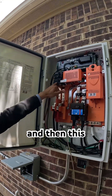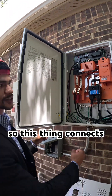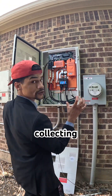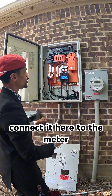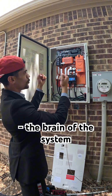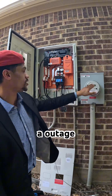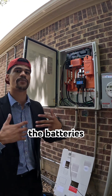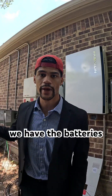This 125-amp breaker is for the batteries. This unit connects directly into the meter, so instead of the meter feeding directly into your main panel — which is just on the other side of this wall — we connect it here to the meter and then go from the AGate2, the brain of the system, back into the box. Now if we detect an outage in the box, it goes to the APower2 first; it detects the outage, the batteries take over, and you don't even notice the power turning off.